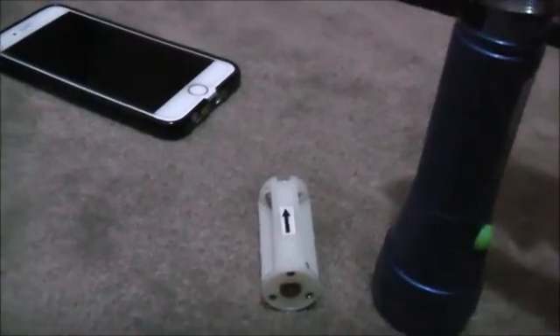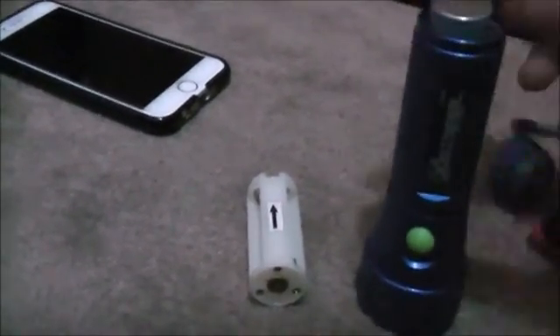There's obviously a lack of battery protection circuitry, so if this runs too flat, there's no protection of that battery — that's the only drawback. It fits in and this thing screws all the way on without damage to the battery. I squashed that plate down — I put a screwdriver handle there and just squashed that divot down. So you can see there's a bit of clearance, but because of that spring there's a lot of give in it — this battery is about a centimetre longer, but the spring is just enough to allow the 18650 to fit inside.